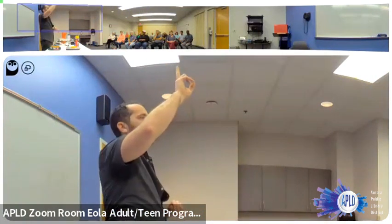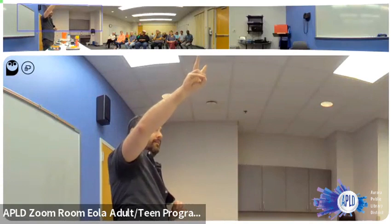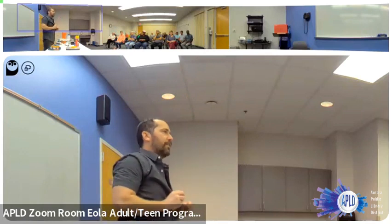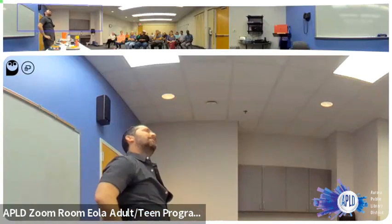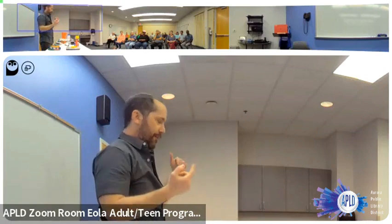What I want you to have, if you're gonna do any electrical, is two separate devices, two because of redundancy, okay? That way, if they give different results, you investigate further. Well, this one says the power's off, and this one says the power's on. Who will I trust? No, they both need to say the power's off, okay?